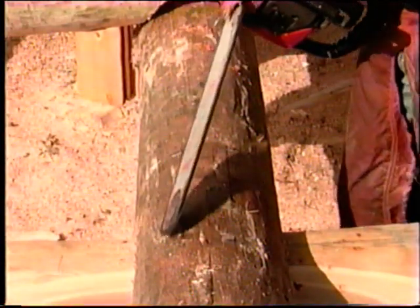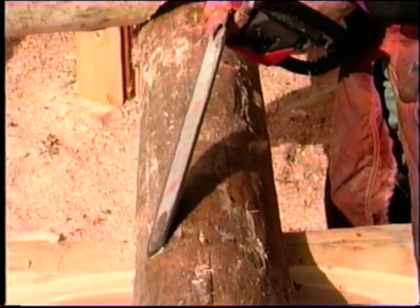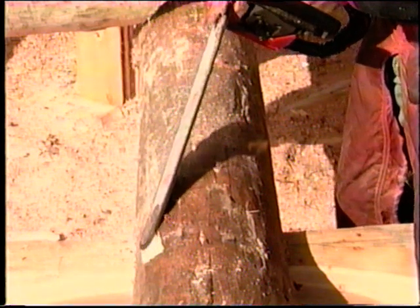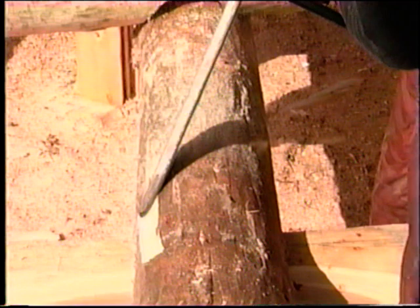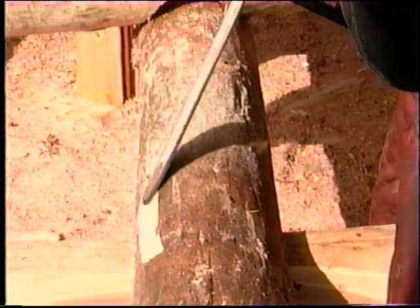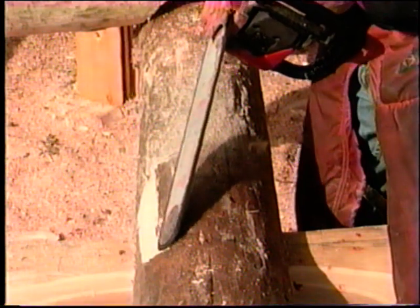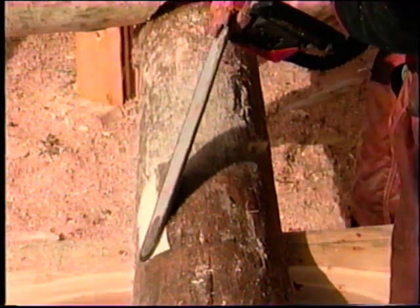The lower half of the notch is done much the same as the previous example. Cut a flat plane from the level line to the double scribe line and dress it out. Obviously, the more accurately this work is done, the better, and more natural will be the final appearance. I think it is a good and useful notch.